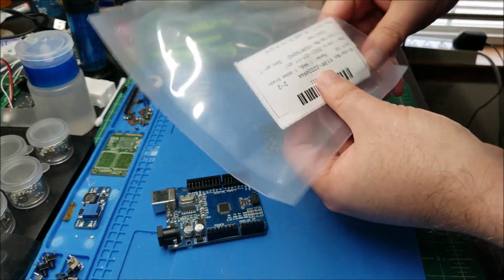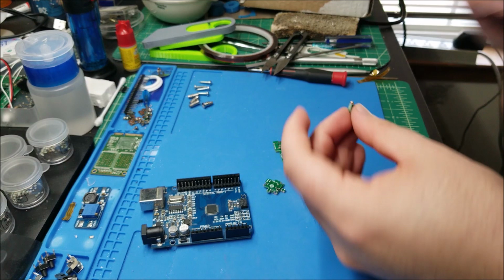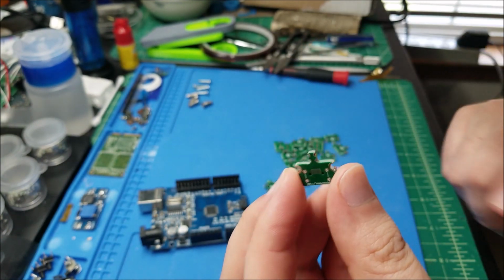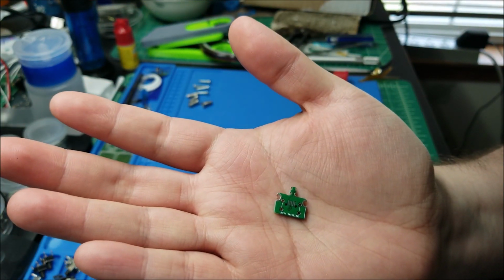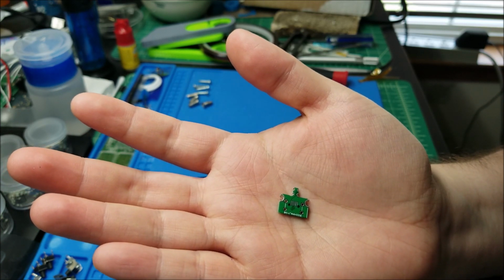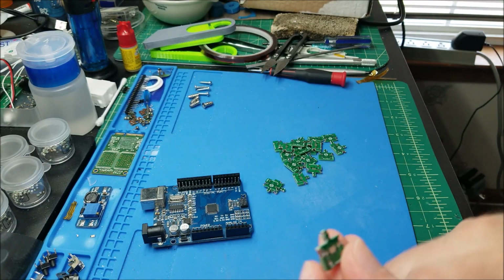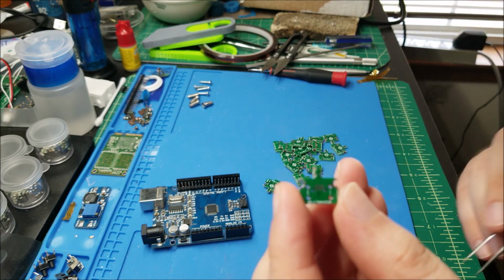Just from looking at these real quick, I was actually a little bit naughty in designing these. You might see if I get a real close-up of them, there's a lot of junk in the cutoff areas, and I saw one or two of them where the pads were completely ripped off. There's a selection you can make when ordering PCBs, not just through JLCPCB, but any PCB manufacturer will have something similar, where you have to specify if you are going to do castellated pads, and they charge you a significant amount more. It's something like a $15 engineering fee on top of the PCB cost. So I thought I'd be a little bit naughty and not tell them that I am using castellated pads, and just have the route-out bit cut through regular pads in my design.